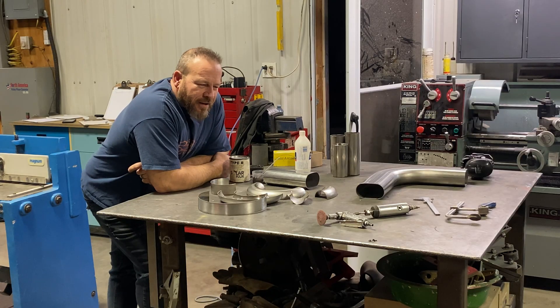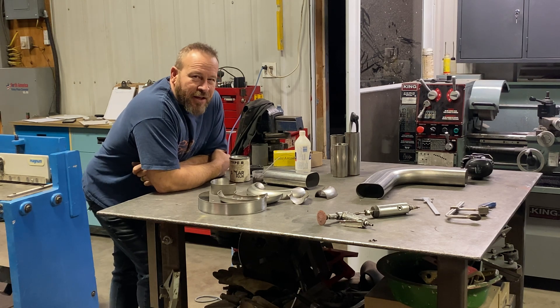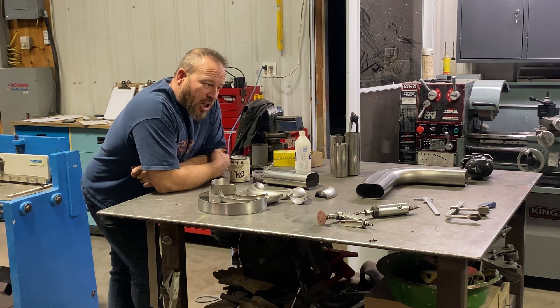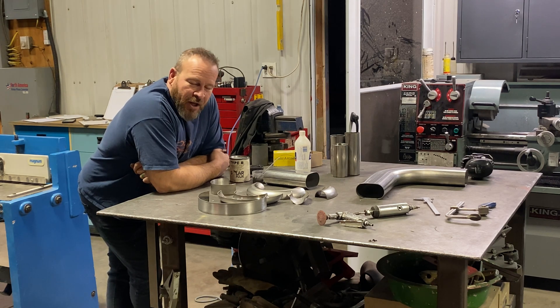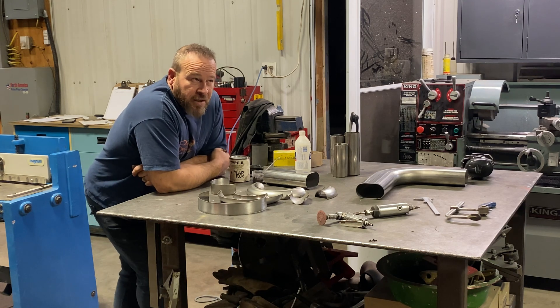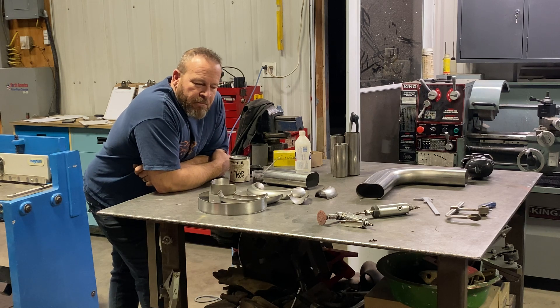How I'm dealing with this is one way — there are lots of ways to put an oval exhaust together like this. A lot of guys will do pie cuts and whatever. This is what I'm choosing to do. The other thing I'm choosing to do on this exhaust — and what I do on a lot of exhaust — is back purge with argon. You have to protect the back of the stainless steel weld.